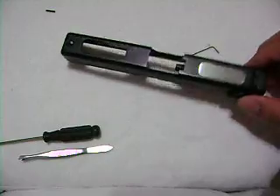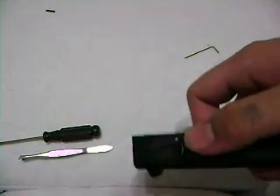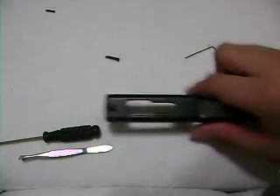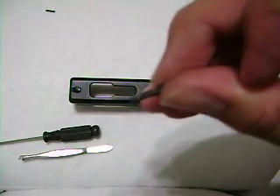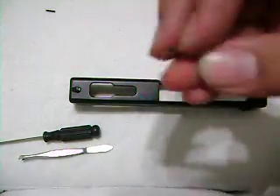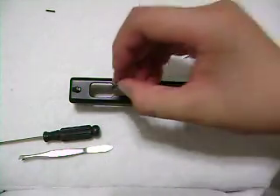Memorize which end goes in. I'm going to put my rear sight back into place. You'll notice that when this gun is set on safe or full auto, that pin will not come out. When you set it on semi-auto, there it is — the pin. A lot of people with the Glock lose this pin — it's not that hard to lose. If you tighten that screw in there, you will not lose it.